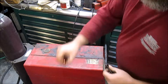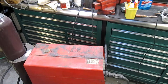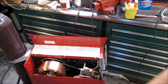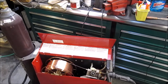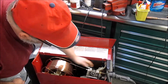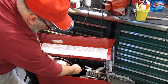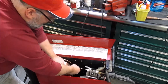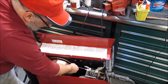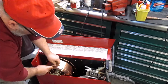This is an 023 tip, so I've got that ready. First thing to do is release the drive. A lot of guys will just cut this off and pull it out of the gun. I don't think it takes that much work to roll it backwards — and that's 12 feet of wire that I can use for something else. Now, hold on to this. If you let go, it's going to bird's nest on you and make a big mess.